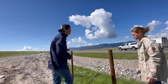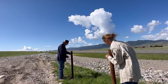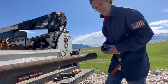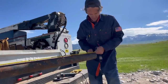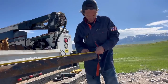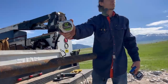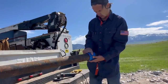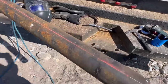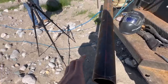Now we deploy our measurements — we'll be going from outside to outside. 95 and 5 and 8. 94 and 3 and 8. While she's doing that, I'm going to get my measurement over here. I don't even know if this is enough. That's the longer measurement — that's the bridge at the coping edge. It's the bottom because the bottom of the pipe cuts in. Let me just put the coping jig on it real quick and find out. It's just barely going to work. I struck a center line and that's going to line up the copes, so I can make sure everything is square and lines up once it gets over onto the posts.